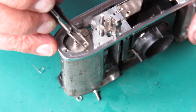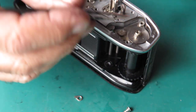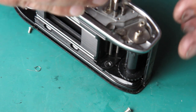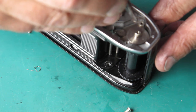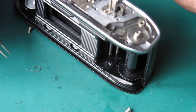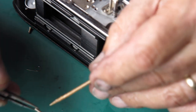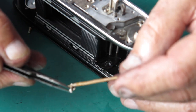That little standoff bush goes in there at the front — one side of it is countersunk, so make sure the countersunk side is down. That little ratchet ball goes on there; I normally put a touch of synthetic grease on the top of this so that the ratchet ball revolves smoothly around that collar.